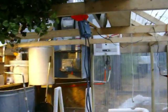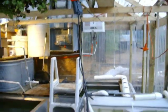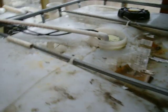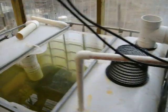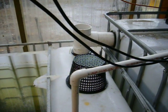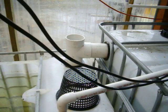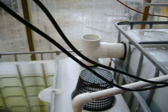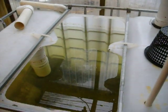which comes through these black air hoses from this small air compressor. After the water passes through the biological portion of the contactor, it goes to the next stage of the filter, which is the clarifier. The biology that sloughs off of the media makes it into the effluent of the biological contactor and settles to the bottom of this clarifier.